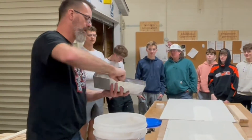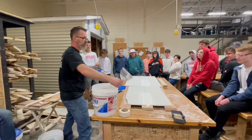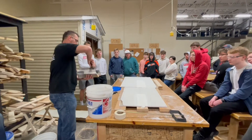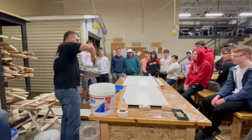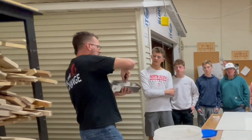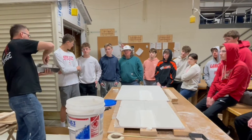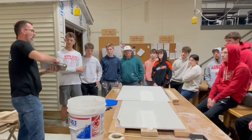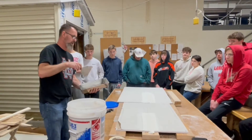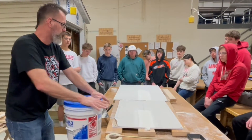When I scoop this out and throw it in here — this has been mixed up with the mixer earlier because it was a little bit dry. This has been sitting for a year. Normally there are all kinds of air bubbles in it, so I'll take my six-inch knife and just run it through here to knock all the air bubbles out. If I don't do this, as I'm trying to apply the mud I'm going to notice there are just all kinds of air bubbles in it. So I've got my mud out — I'm going to put my lid on immediately so it doesn't dry out.